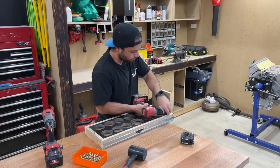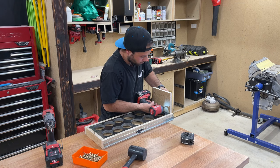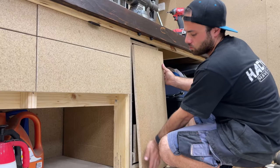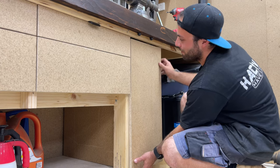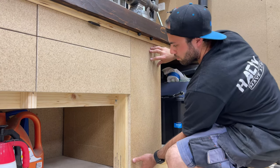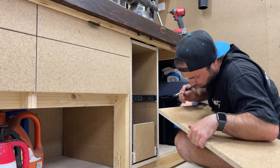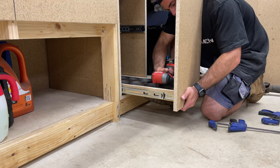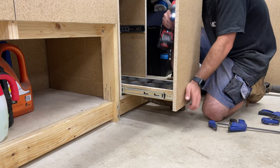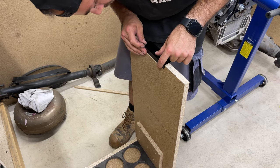Like I've done for the rest of my drawers, I'll drill a couple of holes in the drawer unit itself and stick a few screws through so they're just poking out, line it up with the door when it's sitting in place, give it a bit of a kick, find the little dints the screw holes made on the inside, and that's what I'll line it up with when I screw it back in. Next I put the handle on and then Bob's your uncle — she's all done.